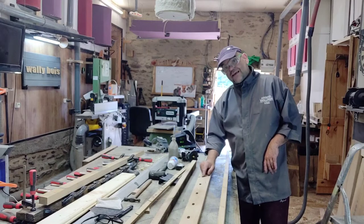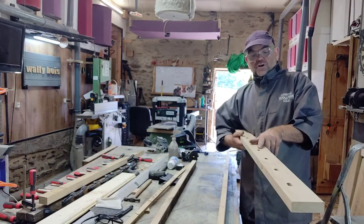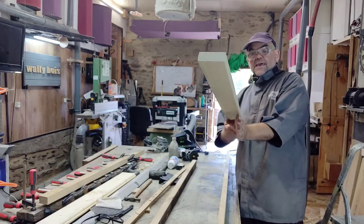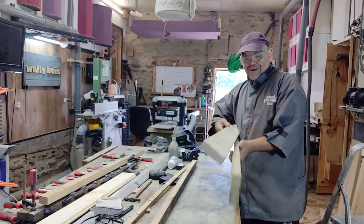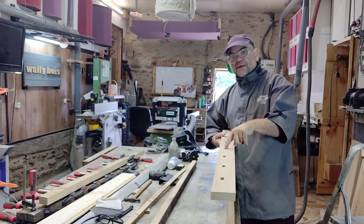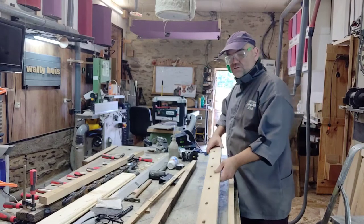I know that my distance from the inside edge — so for instance if I'm walking along my bridge and there's a drop down to the left, my inside edge of my base rail in this case is slightly narrow to the centre line of the actual spindle to the outside edge. The reason for that is this is going to overhang the wall slightly here, and then there's going to be an apron piece here — it's going to be mounted kind of like that, that trims the edge of the wall, and it looks really neat. So if I put them right down the centre they wouldn't line up correctly with a handrail, and obviously that's quite important — if you don't get them in the right place, the handrail ones are going to be too far one way or the other. You're limited on your handrail depending on the centre line of your newel posts, so everything is progressive — one thing affects another thing, it's cumulative.